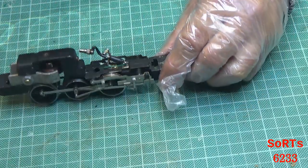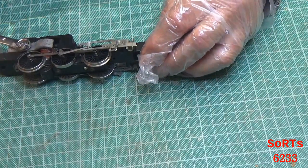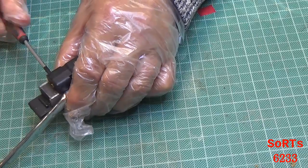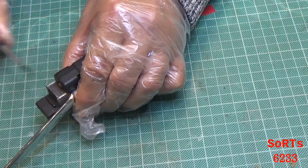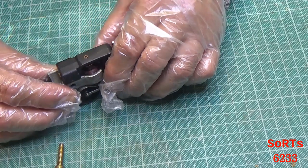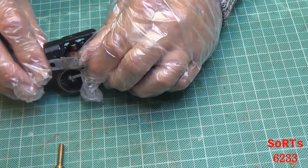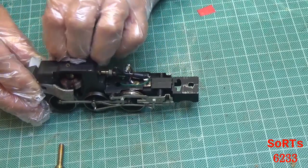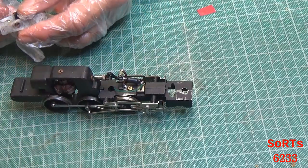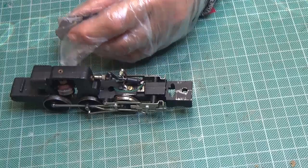Let's get the magnet out. It's held in by this huge screw and this nut, which is a size 6. There we go, and that allows the screw to come through. Now, if my understanding is correct, when I remove this, and this, I have to remove the magnet and the pole pieces almost simultaneously. It helps to reduce the drain of the magnetic field or something of that ilk. Either way, I'm going to keep it together, and the nut just in there.